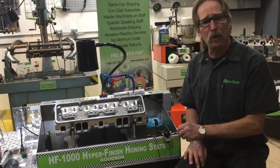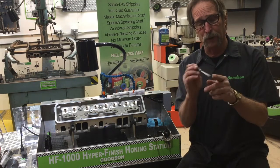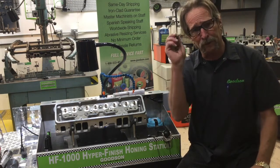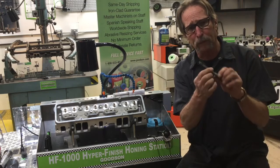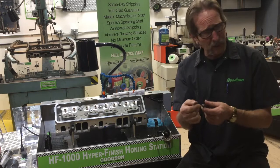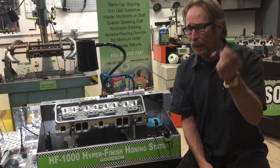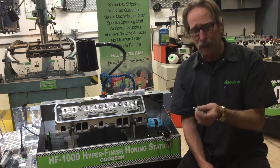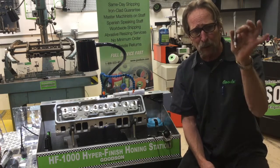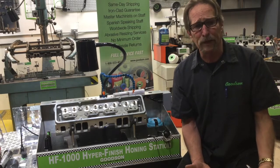The original tool that I came up with — nine, maybe ten years ago now — was a silver tool that incorporated a diamond abrasive for a valve guide hone. It's got about a one millimeter, or thirty-nine thousandths, worth of adjustment. Very, very accurate — we can hold a tenth of a thousandth. People responded to it; I've got them in a lot of performance shops. Very high-end, very particular people have bought into this tool, and it's been working great for years.